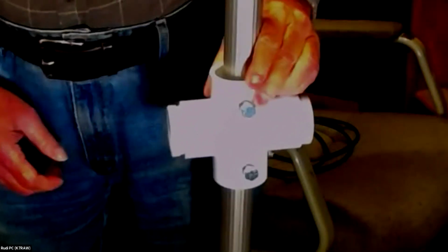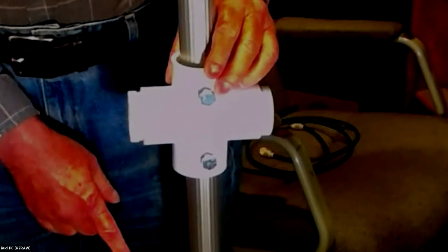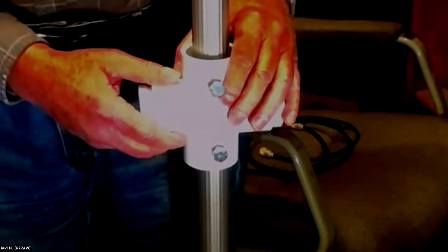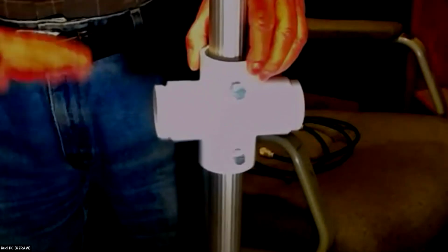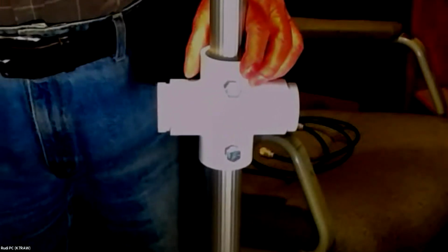So one of the other cool things I did is I stick the base of this through a tripod. That's a Radio Shack antenna or roof apex mount type antenna base tripod. That holds it up vertically, and then I put this right above it, sitting on top of the tripod. Off to the sides, I've got a couple of pieces of PVC tubing onto which I've mounted a couple of small 10-watt solar panels. So I can just take this and rotate it around and point the solar panels and twist them up and down, point it at the sun, and then I lock it in place with a couple of screws. Now I've got solar panels that keep my battery charged, and I've got 20 watts of solar, which matches up to my G90 just fine.